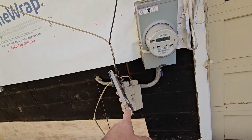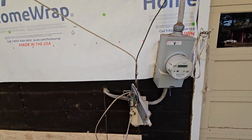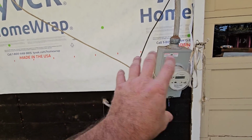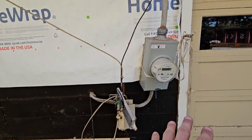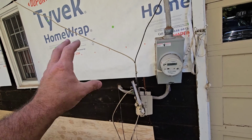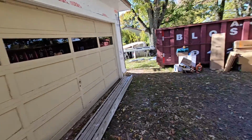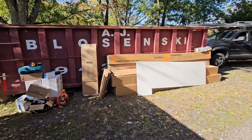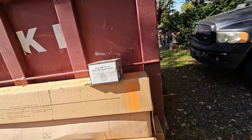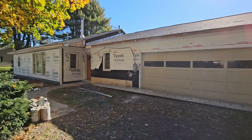We don't want this stuff sitting on the siding, specifically for this siding, because it's blue. The hotter it is, the more movement the siding's going to get, and then it's going to look kinked up here if we screw right into it, because it's going to want to move. So by making this an independent piece of the wall, separate from the siding, we can eliminate any possibility of the siding looking bad as it moves because of the heat, specifically because this is a dark blue color siding. And we're using Monogram D5. We like the double 5 a lot, and it's not just a straight panel, but it is this dark blue color, Pacific blue. So the sun loves to move those things around. Vinyl likes to move, and it will.